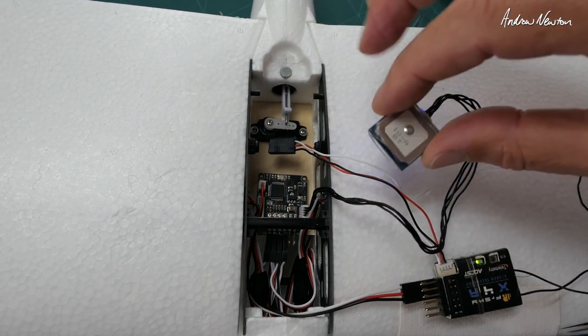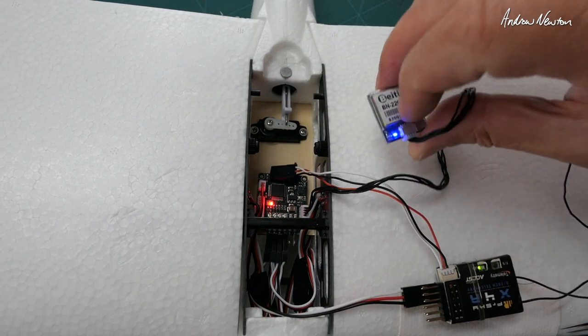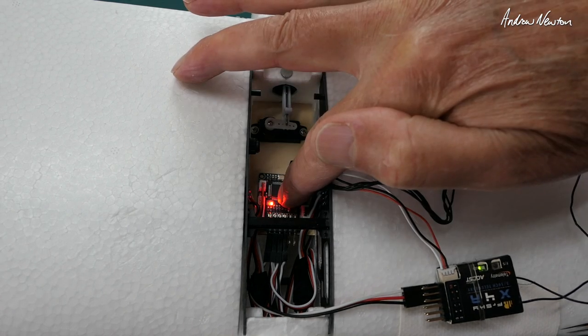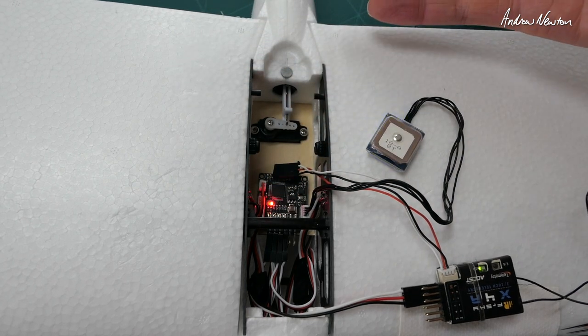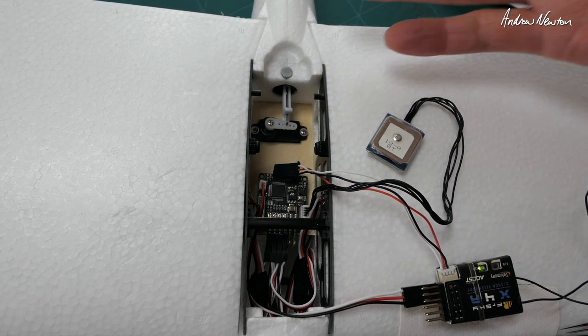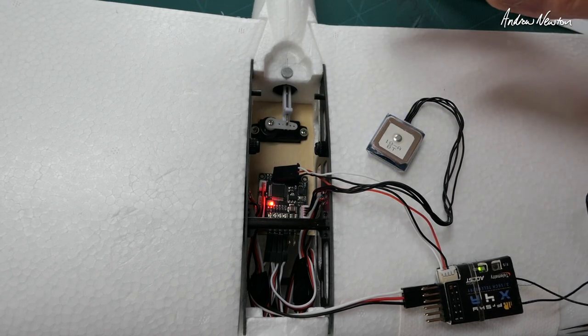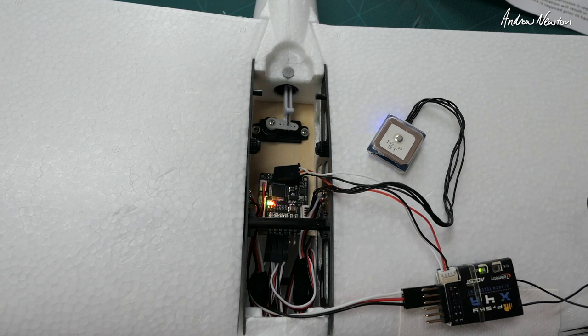If the red LED is not on at all, the GPS isn't connected. We've got the flashing blue light to show the GPS is powered up. Flashing like this it still hasn't acquired more than five satellites, which is what you need to go flying. Once it goes solid, that tells us we have enough satellites. Solid green is return to home mode and you'll get beeping until the GPS has acquired enough satellites. Blinking green is stabilised mode. No green light is manual mode.